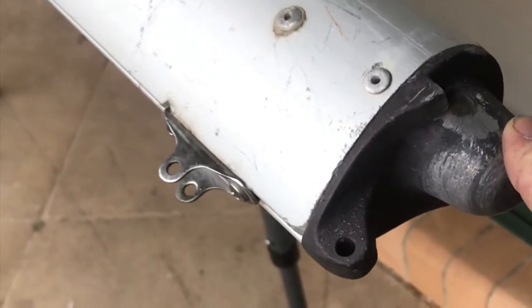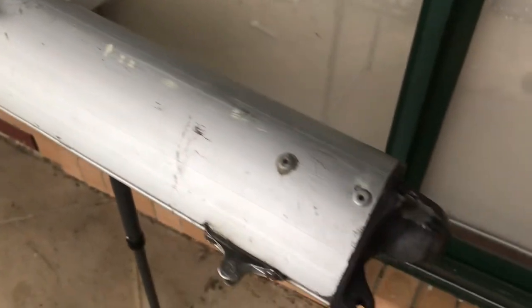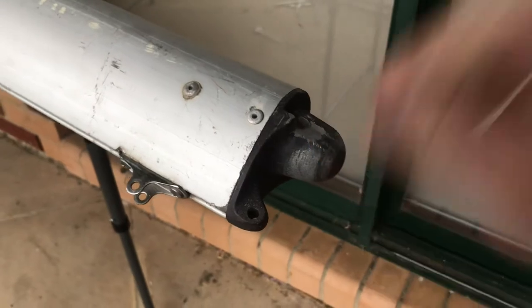The first thing we want to do is knock off the end cap to see what's up the mast — whether there is a foam plug. There's probably only one just here. We're going to inspect to see what's inside this mast, and once we've done the job it needs to be waterproof if the boat goes turtle upside down, otherwise you'll never get your boat off.